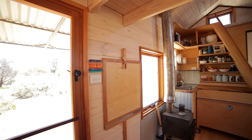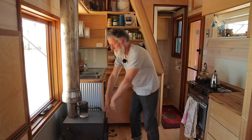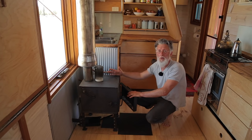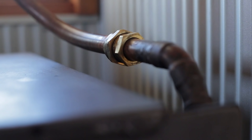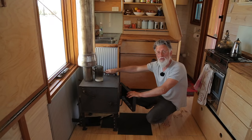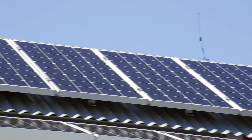I'd like to take you into the kitchen — what a lot of people call the grand room in tiny houses because of all that head height and room to move around. This is the wood heater that heats our space and also acts as a hot water heater. I designed it in SketchUp and then welded it together because there really wasn't anything commercially available that was going to heat water in a tiny space. It puts heat on the copper pipe with water in it, and it's just a thermal siphon — no pump. You heat water and it rises up to the tank.